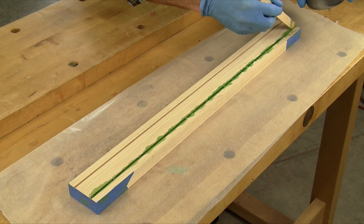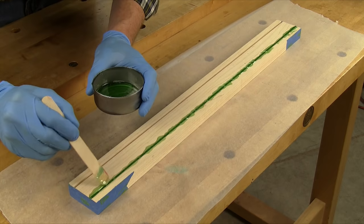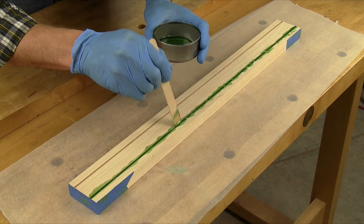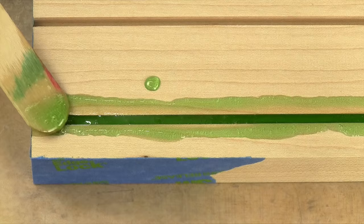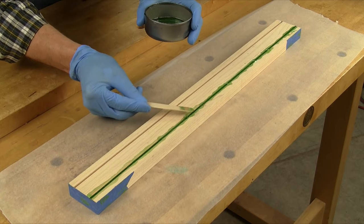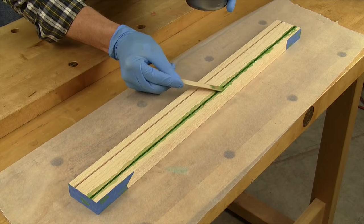Another advantage to having a slow-setting epoxy — this West System epoxy I'm using has about a 20-minute working time — is that it gives the inlay mixture time to let the bubbles start to rise up to the surface so they can pop. But if you see them getting trapped down inside, you can work some of that out pretty easily as you go along, and I'll show you what I do here in just a second. I've got one completely filled. I go back to the beginning of the inlay and sort of work my tongue depressor up and down to get those bubbles up to the top. Some of these will pop out on their own as it begins to cure. Then just smooth it, and what you want to do is overfill these grooves so that you've got more epoxy than you even need. As long as you've got the ends taped up, it won't spill out.